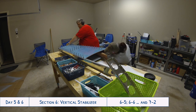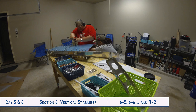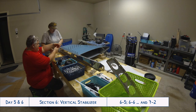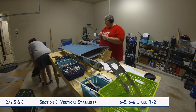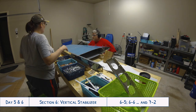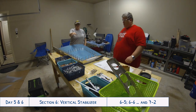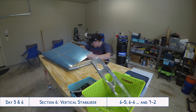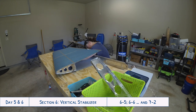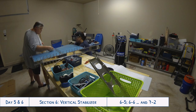The hardest part was near the end where you had to rivet the skin to the forward spar above the middle rib and below the top one. Everything forward of the front spar had been riveted down already, and the top rib is one solid piece — unlike the two on the bottom which you could remove to work on that middle rib. In order to get the bucking bar behind those rivets on the forward spar, you had to get your arms in underneath the skin between the middle rib and the top rib. It was not the most comfortable experience, and this was definitely another thing that really worked out much better as a two-person job.